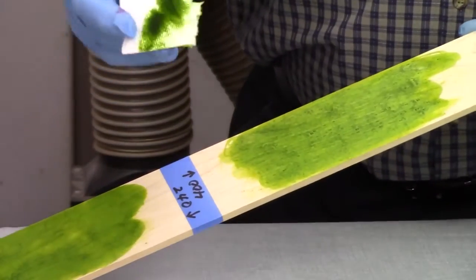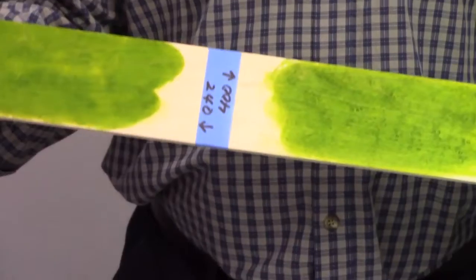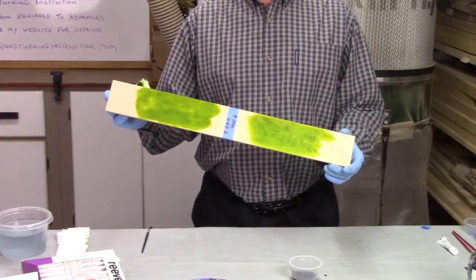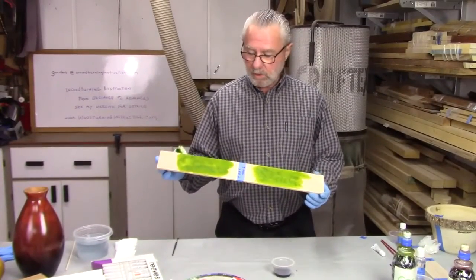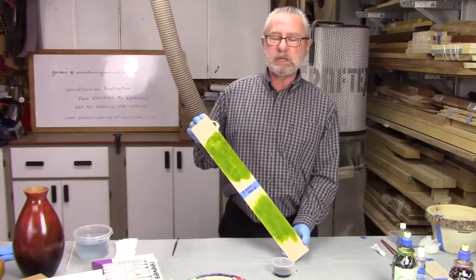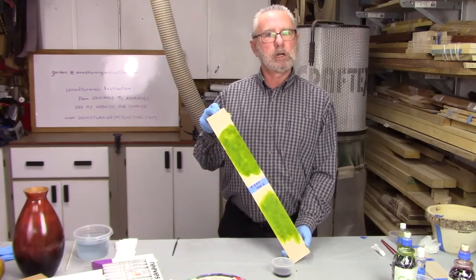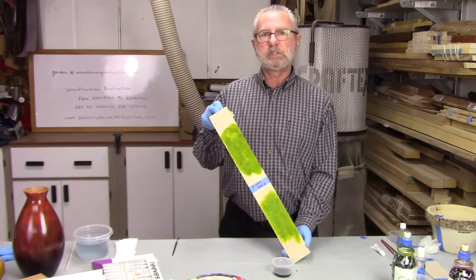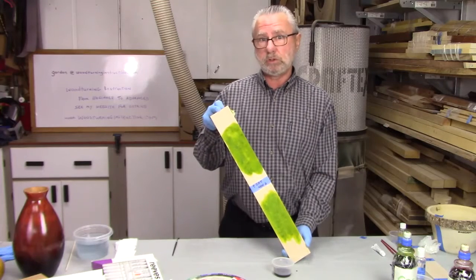But you can see again, a lot of the stain is coming back off. The reason it's coming back is simply because the wood has been burnished to a higher degree, meaning it's a little harder, does not absorb the water and the stain. So you can take from this, if you're looking for a darker color of the wood, it's best to sand it to a lesser degree